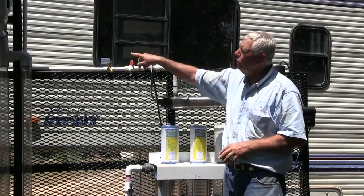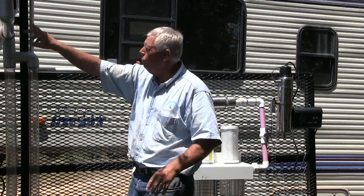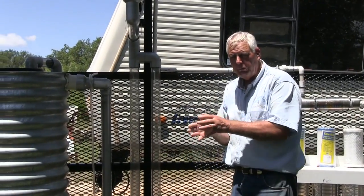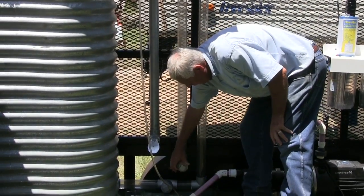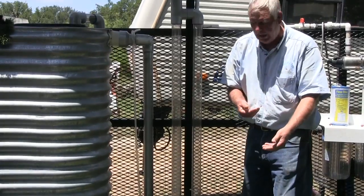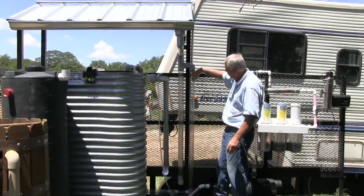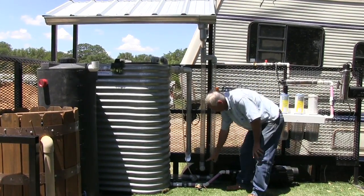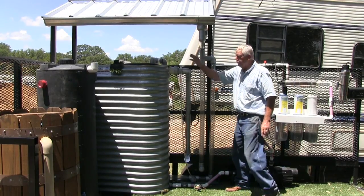Now I'm going to turn this water on so it's going to rain on top of the roof. We're going to follow this water — it's going to fill up the first flush, which is water that's going to be diverted. In the bottom I have a plug left loose, so when it starts to fill up, that water is going to be draining out. Then as it fills up, it's going to overflow into what's called a wet system, where water goes down, across, and rises back up to go into the storage tank.